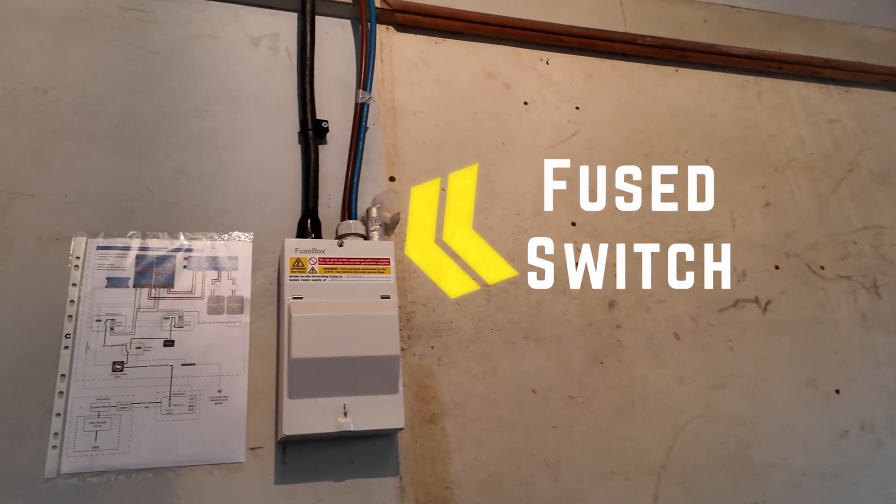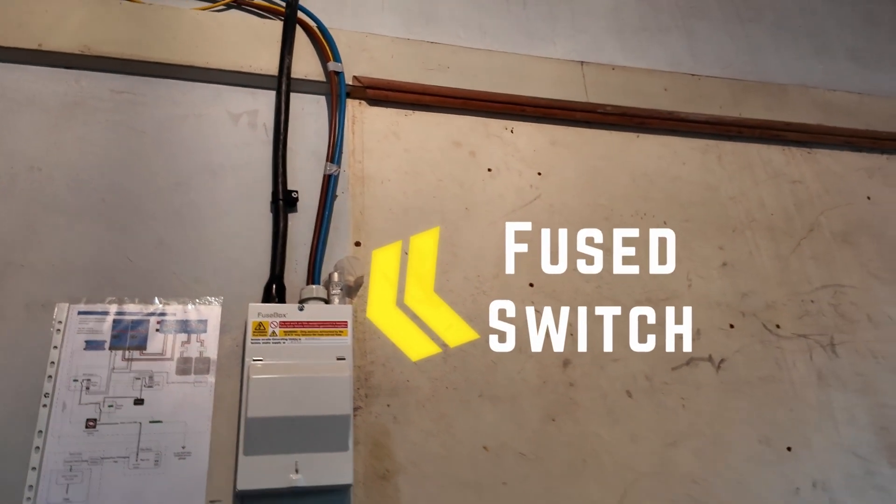This all means I need to get the DNO in to move the cutout and get Octopus Energy in on the same day to move the meter. I then also need to get my electrician to come back in and connect the tails from the meter to the fused switch, which will reconnect the power back to my consumer unit. It's a massive pain in the arse, and there's nothing other than bureaucratic bullshit stopping the DNO from just reconnecting everything. To get the ball rolling, the first step is to contact the DNO and request a service alteration. They will then send someone round to scope out where they work, and it was at this point I realised my simple plan was far from perfect and really wasn't going to work.